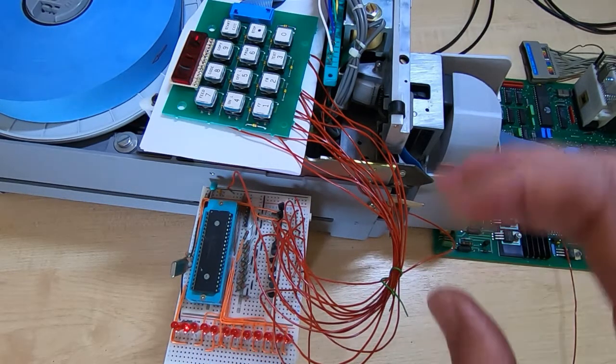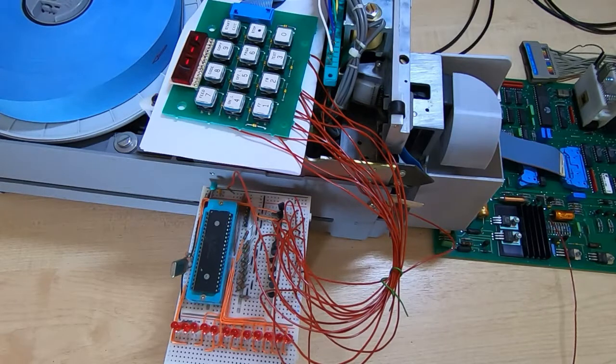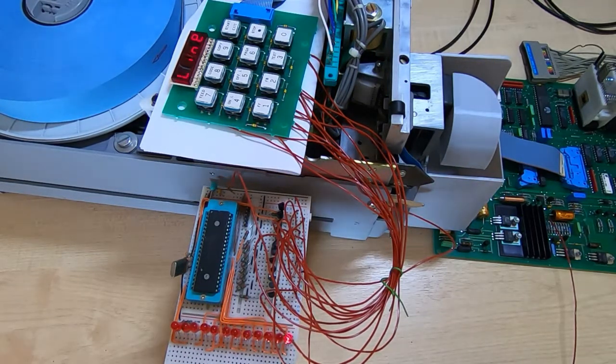I've actually modified the firmware in the processor slightly so it starts about 50 or 60 values before the actual code, just so you can see what happens when it finds it. It's about a minute and a half from the start before it should hit on the correct passcode. Once I've got the correct passcode I can use that to go in and set a new one, or at least know what the default passcode is - allowing me to enter the system through the keyboard and in theory access all the high-level functions I couldn't get to before. We'll just let it continue running and we shouldn't be too far away now.